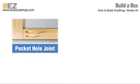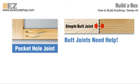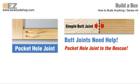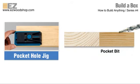Let's take a look at the pocket hole joint. At first glance, a pocket hole joint resembles a simple butt joint — that is, two pieces of wood stuck together end to end. However, a butt joint by itself is relatively weak and usually requires some complicated joinery or extra hardware to hold the boards together. That's where pocket hole joints come to the rescue. To make a pocket hole joint, you'll need a pocket hole jig — a special tool that comes with a pocket bit that creates a pocket hole, providing a path for a pocket screw. This creates a remarkably strong joint between two boards, and in most cases you won't even need to use glue.